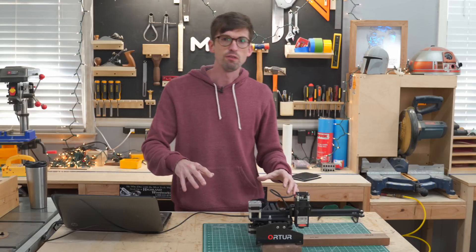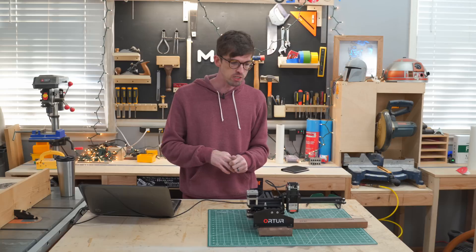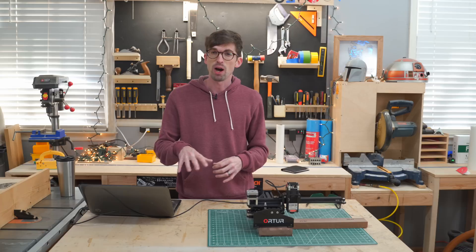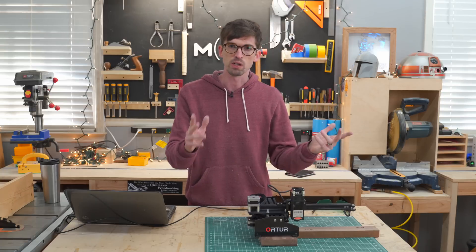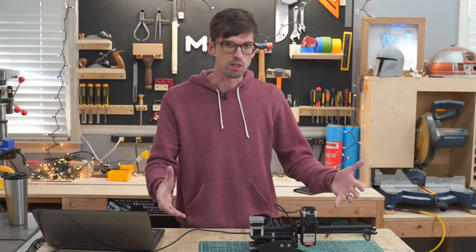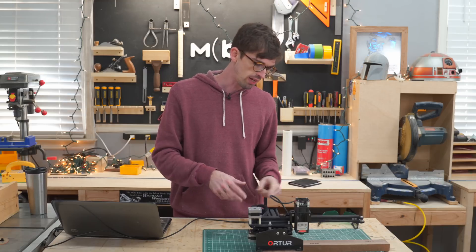There was another unit I reviewed at about the same price — a little under $200 — that also had a CNC built in. But just from the laser side of things I actually like this better. That machine only had about a 5-watt laser and this one is 15 watts. The controller is open source, the gantry is super easy, and when you're laser engraving you don't need a ton of rigidity because you're not pushing against things — you just need to make sure it doesn't wobble.